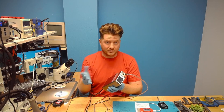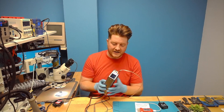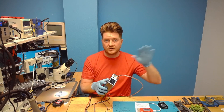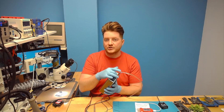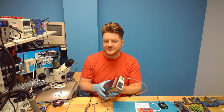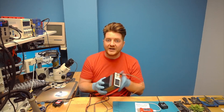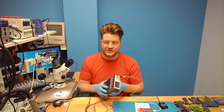This particular one, to give you a quick overview, is basically three devices built into one. It has the banana plugs which you can inject voltage with. It has the battery simulator where you can plug in USBs that go to the battery connector to simulate a battery being plugged in. It also has two charging ports so you can monitor battery charging. It replaces a whole lot of devices, but the only one we're going to talk about today is the banana plugs and how you inject voltage — and exactly how useful and convenient and user-friendly that is in a repair shop.